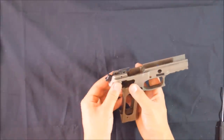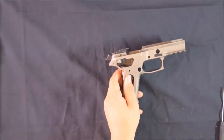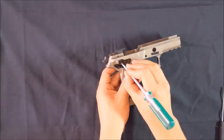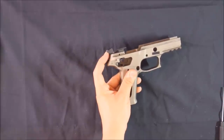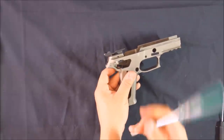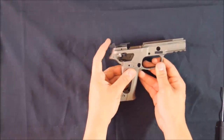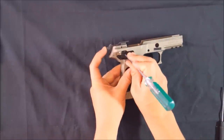Now just make sure the hammer is in the right position for the sear. The hammer is in the cocked position right now. There's no mainspring in the gun, so if I release the sear — as if pulling the trigger — the hammer won't fly forward. I'll push the sear, pull the trigger, the gun fires, and then the hammer resets and clicks into place. The hammer return spring should put rearward pressure on the hammer. We'll leave it uncocked for now because when we put the mainspring back in it'll make life a bit easier.